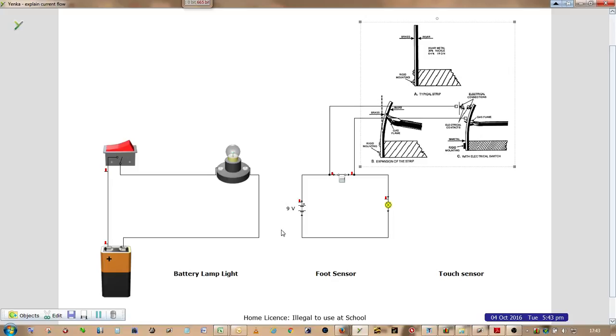So as I said, it's more about temperature in this sense. We're controlling the heat through just a piece of metal, using it as an automatic switch, based on the property that it will bend and retract. And we're saying that is a sensor, it's a heat sensor. Otherwise it's just a piece of metal attached to a switch, or rather a circuit. Hope that is clear for you.